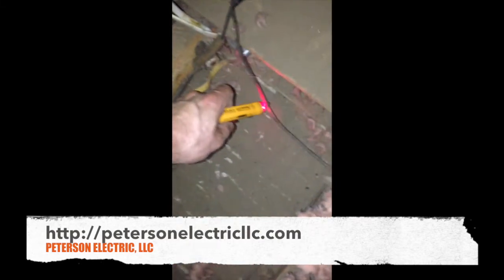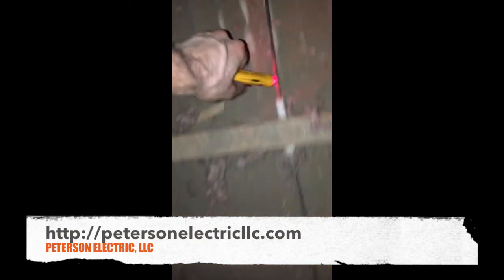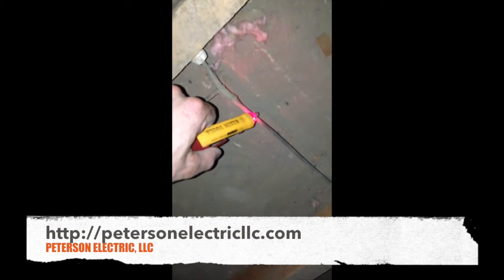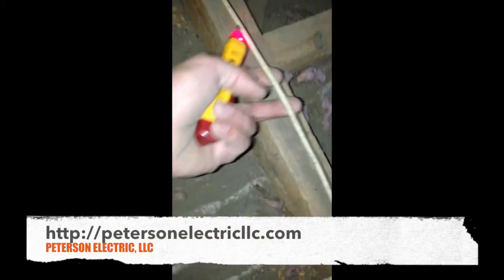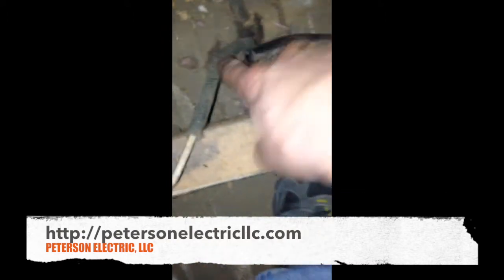That yellow wire was making it pick up. There's a little bit coming back the closer you get to the splice, because these things don't know the difference. But a true 120 will be constant the whole time. This is the neutral — but it's picking it up here. One side of the splice, no. This is definitely my hot right here. Here's another splice for knob and tube. This way was towards the panel; this way is towards the front of the home, away from the panel. So we're feeding current this way, coming across, hitting two porcelain knobs. Here's my hot going down — this is the outlet that fried. My wife was pounding with a broomstick and I felt it vibrate right here. I labeled it eight, and I've already done my homework for hours. This goes down; this neutral's coming back up. This is the one that fried. The current had to come up, go through this splice, and start heading back home through all that problem.